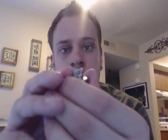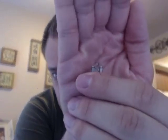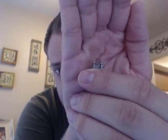One important thing to note — I figured this out when I caused my atty to short out — you want your coil up off the base. If it is touching the base or that air hole, your atty will short out. On something like a ProVari nothing will happen, it'll just give you an E1, but on a mechanical mod it'll heat the hell out of your mod and your batteries will heat up and it just won't be a fun time.